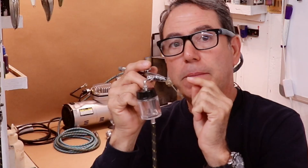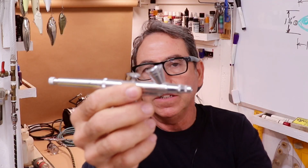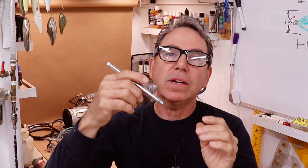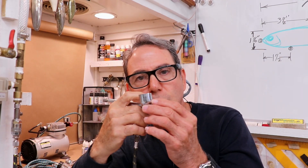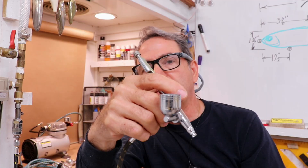If you're painting on canvas with broad strokes and using a lot of paint, those jar siphon-style guns are handy because you can just have different colors in different jars and swap them as needed. But if you're painting small stuff, this tends to be overkill. The amount of paint you need would probably get stuck in the little siphon tube every time. That's why people use the gravity-feed style — this one has a tiny reservoir cup. The smaller the amount of paint needed, the smaller cup you want, so you waste less paint and it's easier to clean. An alternative is the side-draw gravity-feed gun, which gives you a slightly larger reservoir and lets you change the angle so you'll never get spillage when painting straight down.